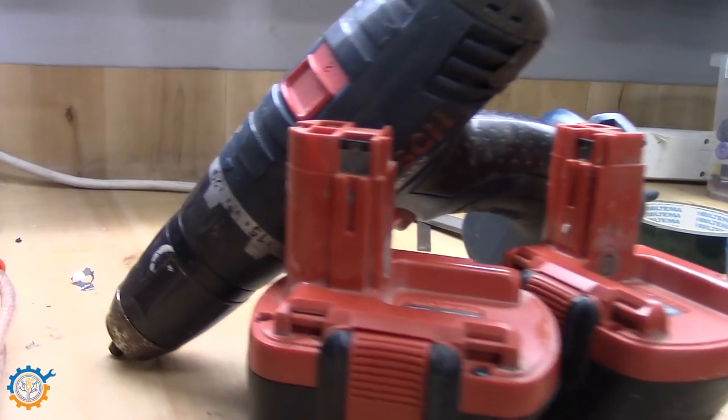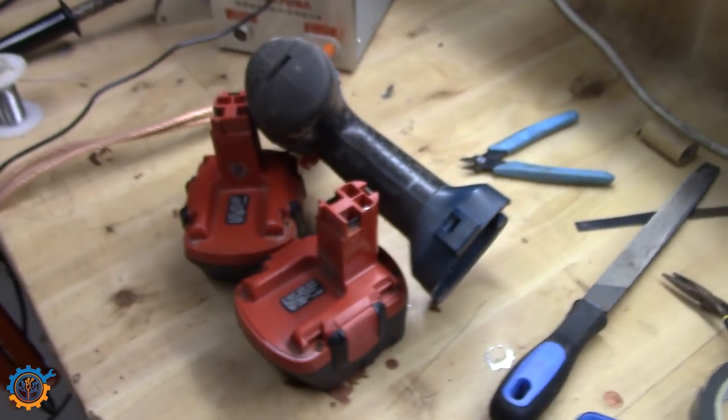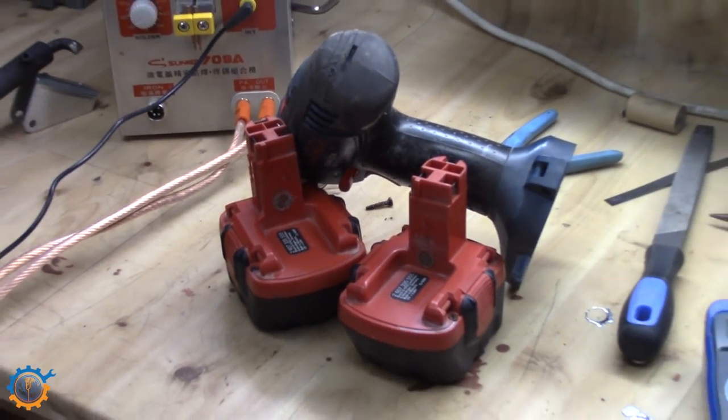I am really happy with the result, and this screwdriver can hopefully live a couple more years. It is beaten up but it has done a lot of work for me — it was one of my first real screwdrivers I bought. As you can see there were rather rusty screws, because they had been in the box with a leaking cell that I had left. So guys, this was a quickie. I fixed my screwdriver — the old one with nickel metal hydride batteries. I did not convert to lithium ion batteries this time, because if I did I would need to change the charging circuit and everything. I had spare batteries that I bought several years ago. The first pack I had already tried once but had one faulty battery from the start, so I changed that out. The second one I spot welded together. I hope you liked this video — see you next time, bye!